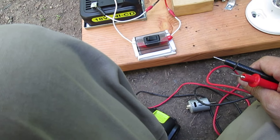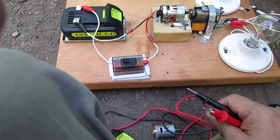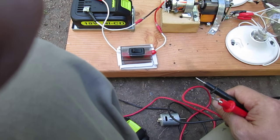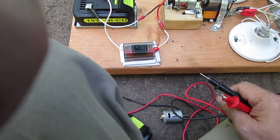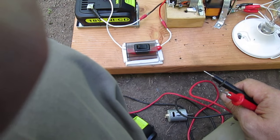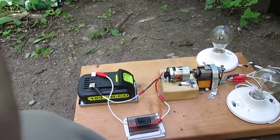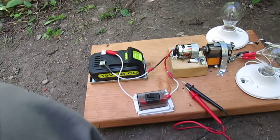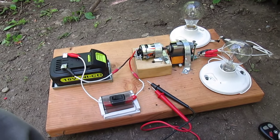So you saw with no load, we're up in the 225 range. My own previous measurements was that when it's under full power, 19 volts, it settles to 225, but it's been as high as 232. It seems to handle 60 watt quite well, but it dims with the 2 60 watts, which would be 120 watt. So my estimate is that it could get up to about 75 watts.